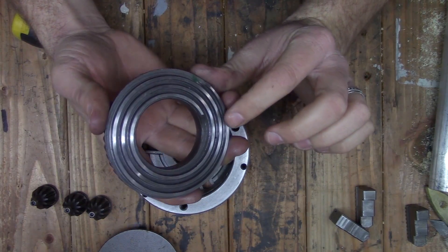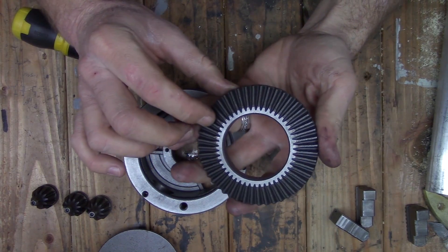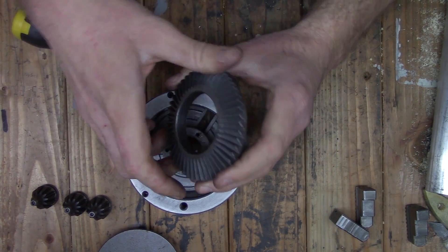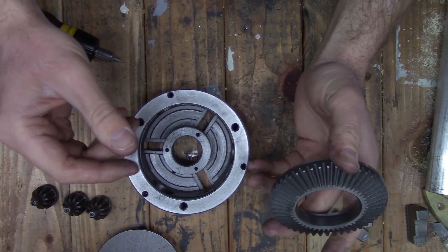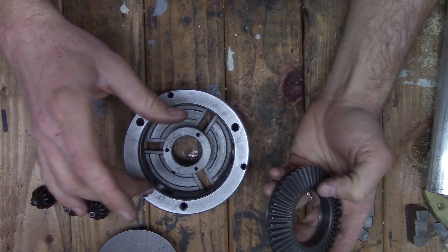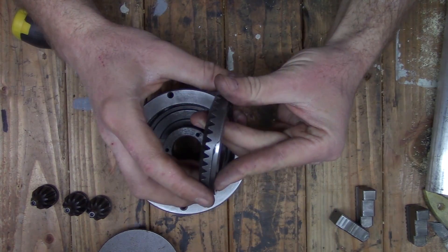The scroll looks very well machined — the surface is all ground. The bevel part of the gears, again, I don't see a whole lot of problems with them, so I think they're going to be okay too. But as I said, there is a grittiness to whatever's on the inside. I don't think this chuck was cleaned after machining — I think they just machined it, put it together, and didn't bother to clean all the swarf from the machining and whatever coolant they used.